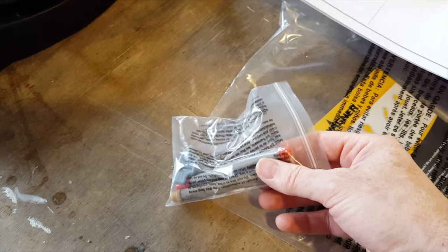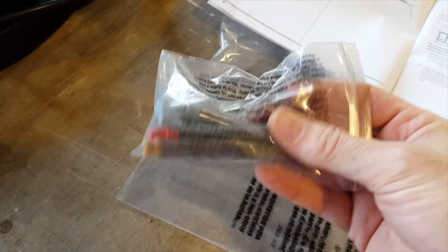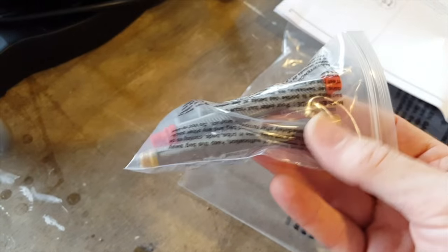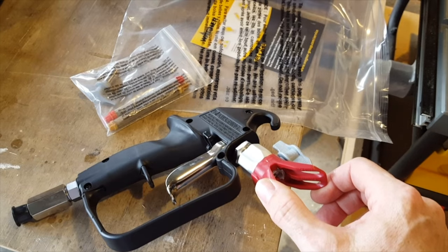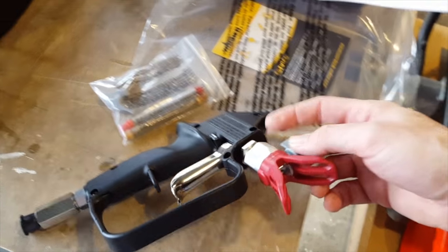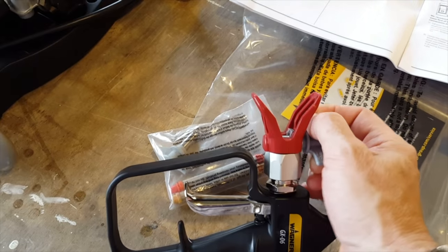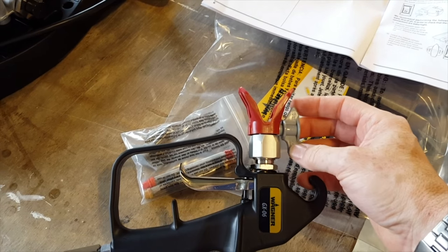The red filter is for extra fine, thin materials like acrylics, paints, primers, and stains. The yellow filter is for thicker paints like internal emulsions and latex paints. For a horrible minute I thought there was only one tip, but checking the gun, there is another tip in there of course. The Wagner system is quite handy in that you can just spin the nozzle around, so if you get blockages you can blast it out the other way, spin back, and off you go again.